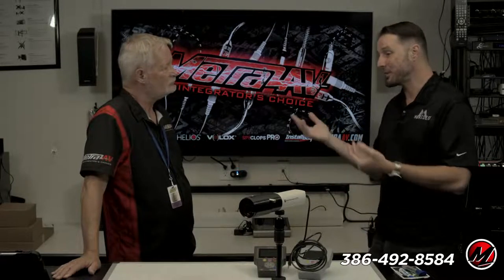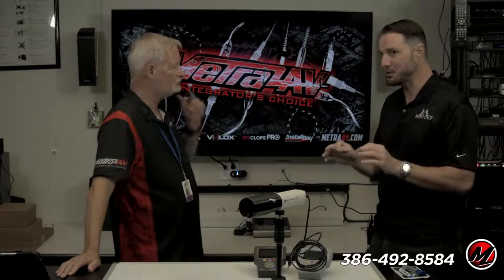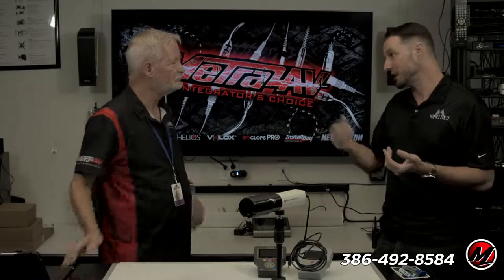And because of that quantum dot layer and because of the new technology they're doing with the heat sink and stuff on the OLED layer, we're able to get easily 1,000 nits out of these hybrids. Which is incredible because we couldn't before. We were topping out at 600-700 nits with a traditional WRGB OLED up until now. So this was the first time in any of our lives that we saw unlimited dynamic range because of perfect black and 1,000 nits all at the same time with a super wide P3 color gamut. So this is one of the reasons why we're all sitting there going, holy crap, this is insane. Like you said, it was a big jump.